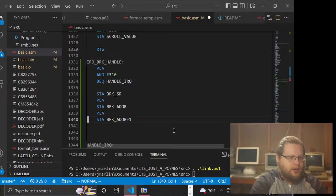But this way I can just write code where it'll calculate the jump table address, do a direct, indirect jump to it, and then when that's done, restore the stack and increase the... That's one benefit of having a fixed block size, is that we can just add the fixed block size to the break address, then put everything back in the stack and call it a day. So yes, let us make up some locations.